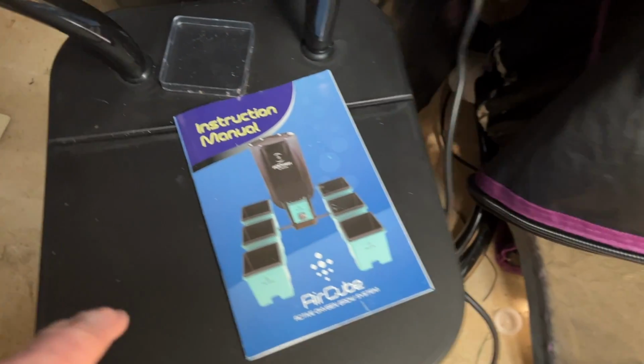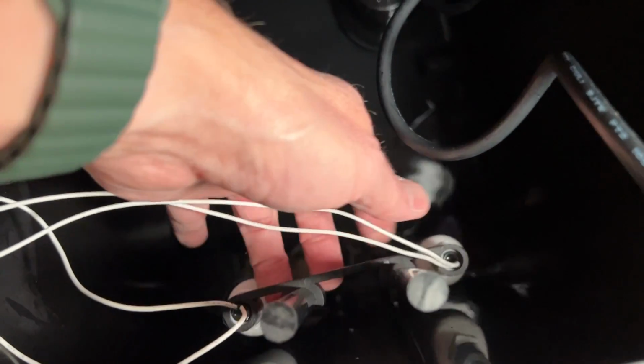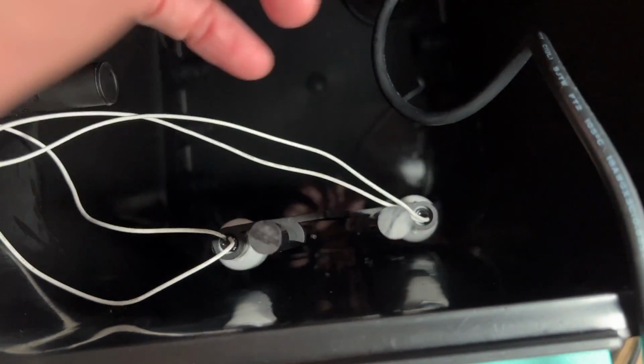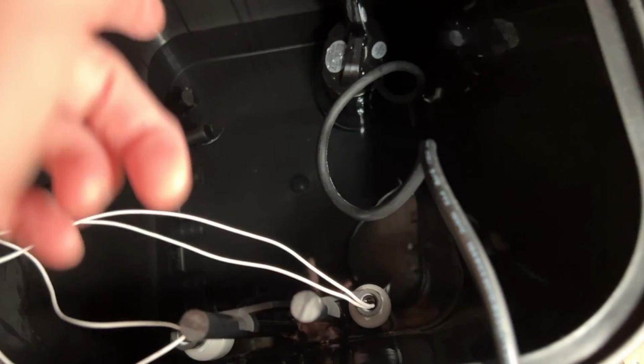The fill pump is inside the reservoir. See at the very bottom. And I don't have it filled up all the way. It's a little over 20 gallons in there. I don't have any nutrients yet, it's just water. So fill pump is in here, pushes water into here, and that has a float valve or float here. When it comes up to whatever you set it to, it makes a connection and it turns the pump off. And the drain pump is inside of here, so when that runs, it's pushing water that's in the buckets back into the reservoir.